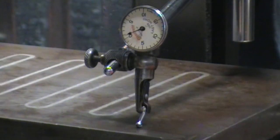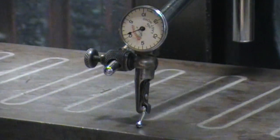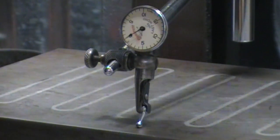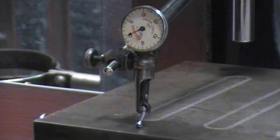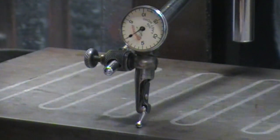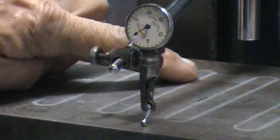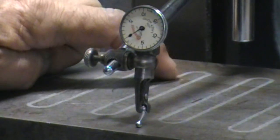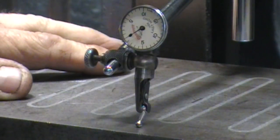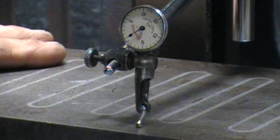And it looks like there was just a little jump. There's a little booger up there. So I would call that pretty darn flat. Or the table track's pretty true. So it's got a little mark back here. Here, let me turn the viewfinder around so I can see. There we go. It's got a little mark right here where someone kissed the mag chuck with the stone, and when we resurface it we're going to take all that out anyway.